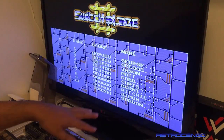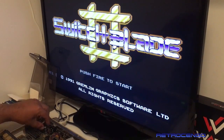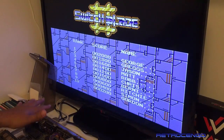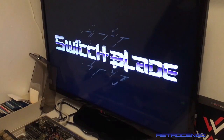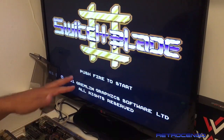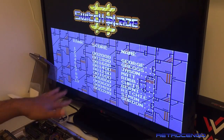Now the Amiga 500 and the Amiga 2000 came with these through-hole caps. Oh, it has been recapped, as I can see up here maybe. They're usually blue and much bigger than these, but I don't know. But these through-hole caps on the Amiga 500s, they're still fine after 30 years, I have never had any issues. Amiga 1200s can have issues, Amiga 600s, they're just all dead. So recap them ASAP. But on these, I have had no headache, man.